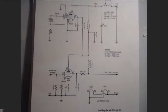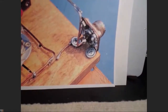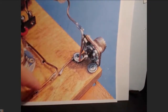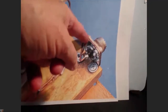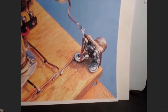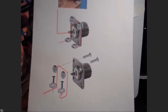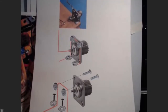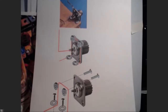I had one other problem when I was doing this. We have a piece of pine board — how are we going to mount the SO-239? You can't drill a hole in it, well you could, but it'd be kind of stupid. So we've shown you how you run the ground path with the number 14 or 12 copper wire, and I made a little cage for it — it worked out really good. There is a drawing that Gene has done for us. That's copper wire and it's really sturdy, it works great. That's how you'll mount that. I have a switch on it also, a push-to-talk switch, and I did that also.